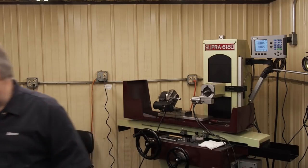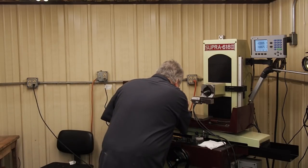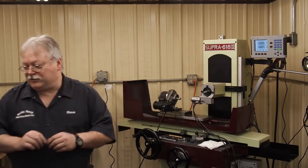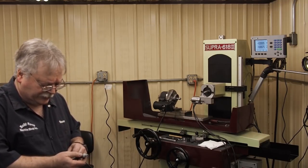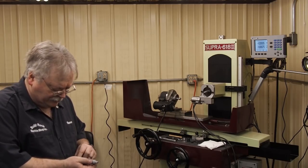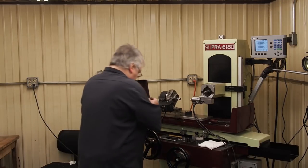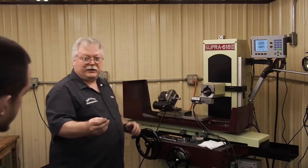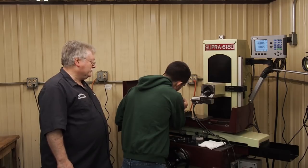In, and it feels a little bit loose. I stopped a few tenths shy of where I wanted to be. And that just wants to start, so let's measure. And it's probably good I stopped. It's 93 and 8. 93 and 8 and a half. So let's go right here. Yeah, I'm going to stop right there. That just barely wants to start at 2 tenths under 94. Oh yeah, perfect.